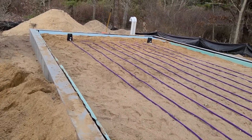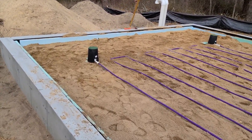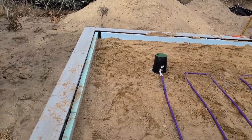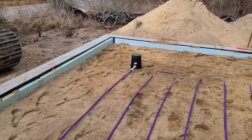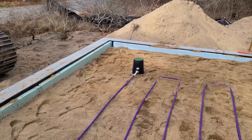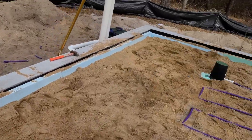Here's our field. We have a little bit of fill extension from the end of the tubing to the retaining wall with insulation. You can imagine when it's sticking up out of the ground like this, there could be a chance for lateral frost. So the site contractor and engineer did a good job setting it up to achieve insulation on the inside of the wall to prevent that side frost.